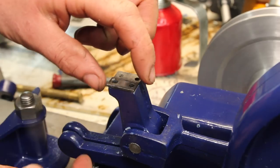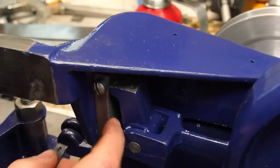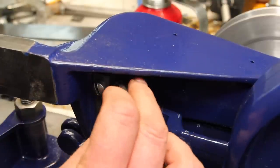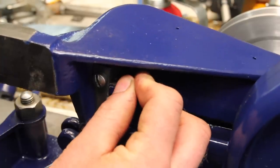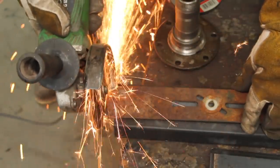So this little lifter mechanism has these little plates on it with teeth. They're supposed to engage with this piece, but the teeth are worn off to the point where they no longer engage. I think I'll use some lawnmower blade for these. Should hold an edge.